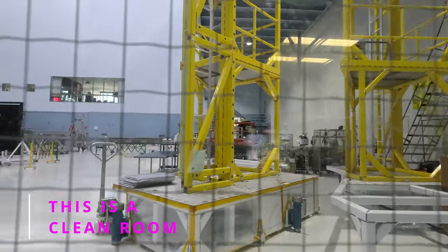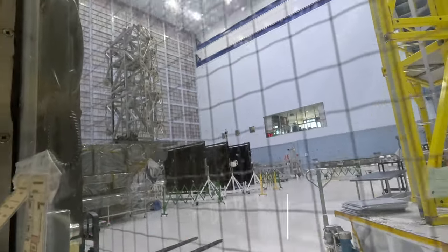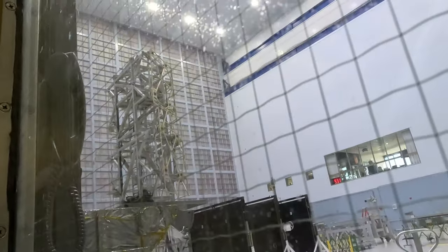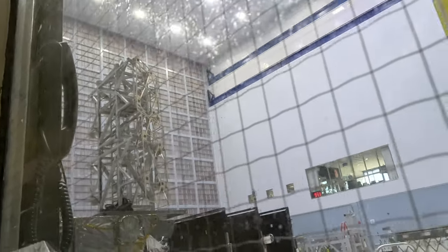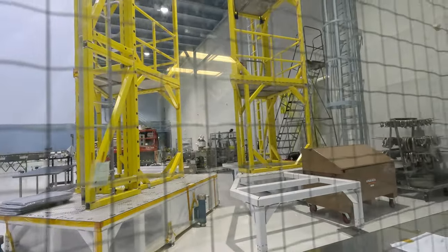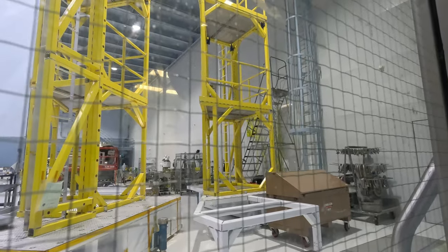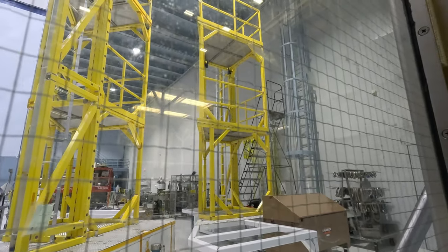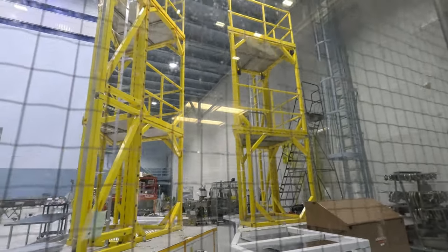Behind there, of course, is a huge plenum. Air goes through. This other side is the return plenum. You can actually walk in there, in between both ends of it. Where's the air being pushed or pulled? Pushed from the HEPA filters out, and this wall here is actually perforated. You go through there, and then it goes up, and the air handling units are up on top with the makeup air and the filtering and everything like that. So they are doing some outside air with closed loop.